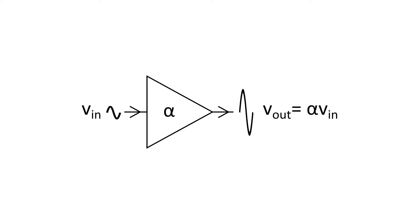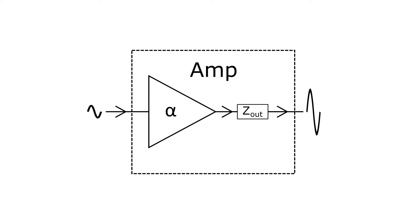But before we start, I want to say a few words about what damping factor is and how it ought to affect your tone. A simple model of an amplifier is just a constant gain voltage multiplier — it will produce an output of alpha times the input voltage regardless of the load it is driving. In reality though, an amplifier has some non-zero output impedance, although in some cases it can be close enough to zero that we don't have to worry about it.